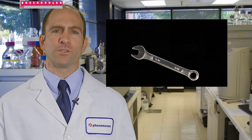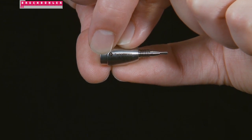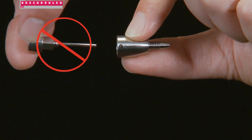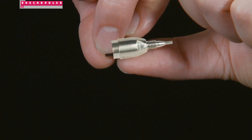In order to install it correctly, you will need one 5/16-inch (8mm) wrench to hold the cartridge, and a second wrench whose size will depend on the column hardware — for this video we are using a 3/8-inch wrench. Now let's begin. First, inspect the Security Guard Ultra holder: inspect the tube base and the floating nut, but do not separate the two pieces that comprise the Security Guard Ultra cartridge holder. Ensure that these two pieces are completely coupled together.